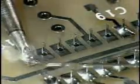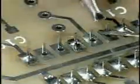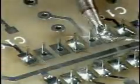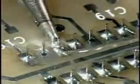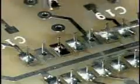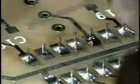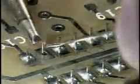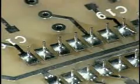The thing to keep in mind is that you should always use the lowest temperature possible for the soldering operation to avoid the potential of damaging the assembly. The temperature of the soldering iron must be sufficient to adequately heat all the elements of the solder connection. This will allow the solder to melt and wet all connection areas. Some low residue fluxes have optimum temperatures that may be higher or lower than RMA fluxes.